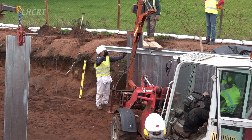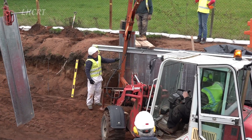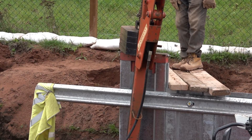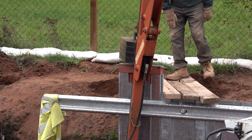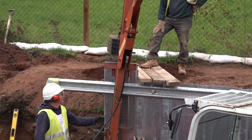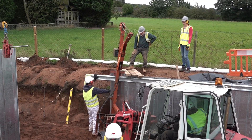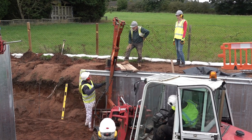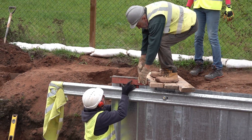That machine over here is lifting the piles — basically lifting and pitching the piles, that's the terminology. They've got an interlock, that's called the clutch. What he's doing now is driving the pile down with a dolly on the top, a protection dolly — like a helmet. It sits on the top and he hits it down so you don't buckle the top of the pile. If you hit the top without the dolly, you'd smash and mangle it. As it is, it comes out fairly good, maybe an odd buckle occasionally.